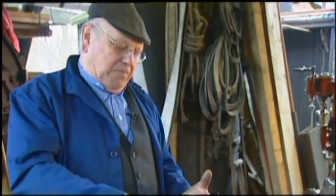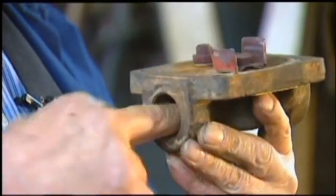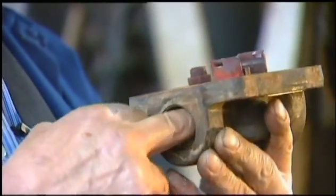The other thing about these mechanical steam traps is all the various orifices in them. Once the steam had gotten going in the wrong direction through the minutest of holes — it's a powerful agent, steam — it drills holes in the cast iron like that. That hole there shouldn't be there. That bit in the middle should be half an inch thick and it's actually eaten it all the way.